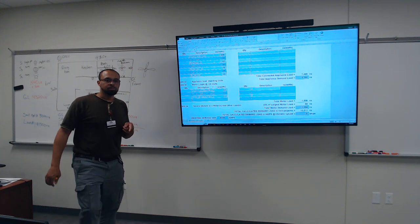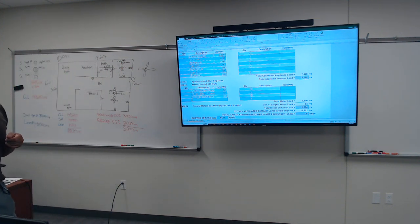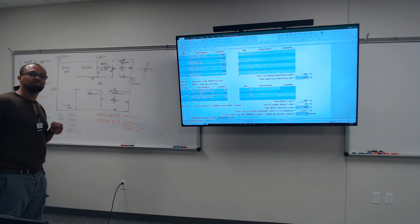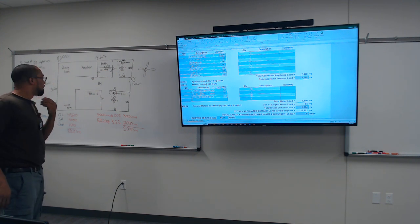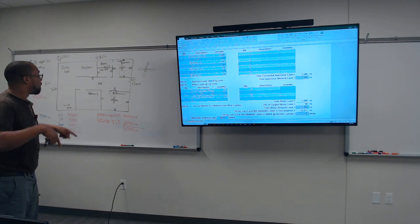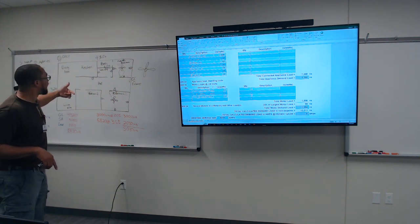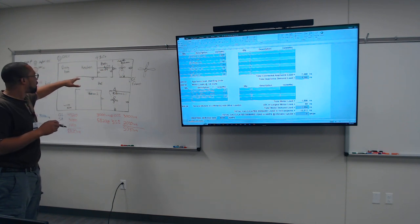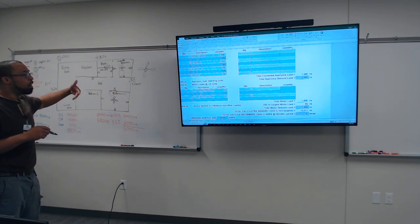I went on a ride along with the residential company, and what they would typically do is put a GFCI at the very beginning of the circuit, so everything following would trip. Yeah, absolutely, and you can do it that way. That's the cheapest route that I've ever seen. All right, so that's what we're gonna do. Regular receptacles are acceptable, but we have to indicate that they are being protected, and put a note that all of the laundry receptacles are protected by that GFCI.